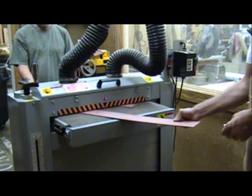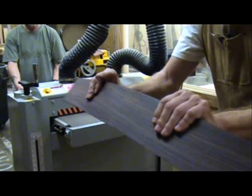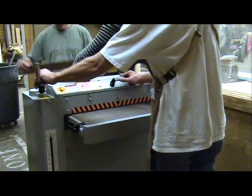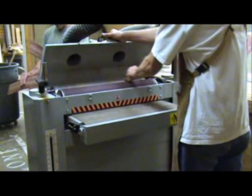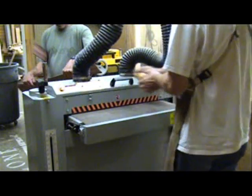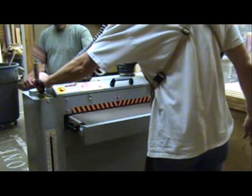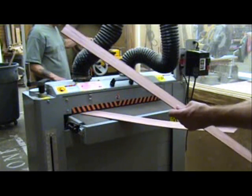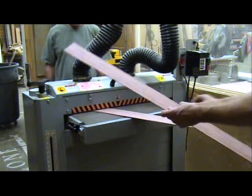Today I would like to talk about thickness sanding sides using a drum sander. I will be showing you how to correctly use this time-saving tool and how by sometimes removing only 1/1000th of an inch more can make a huge difference in the elasticity of your sides. The information I present here will make bending the sides easier later on and reduce the risk of breakage.